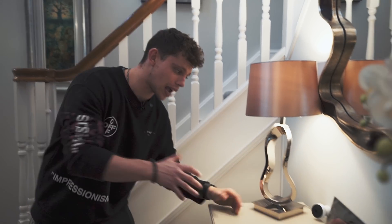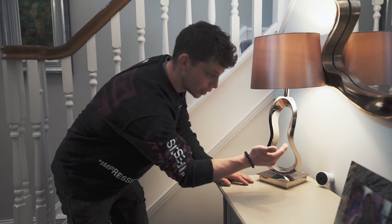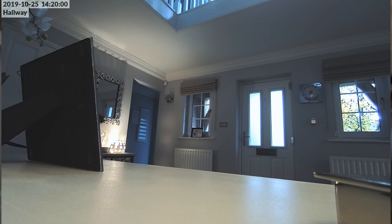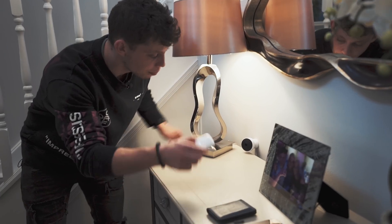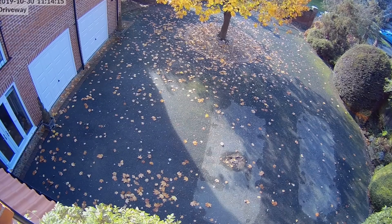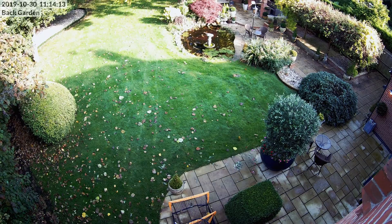Now we need to go onto the CCTV cameras. The G3 Micro is down here — we've just installed this. It's the little camera that has all the different mounting options. I love that it's simply stuck on the wall here; it is so, so tiny — here's some AirPods for scale. Over on the driveway, which is being overwatched by the G3 Pro with optical zoom turned on — the reason I've used this camera here is because it does have optical zoom. The camera's mounted quite high so you can zoom in and still maintain full 1080p quality.